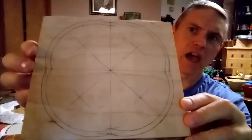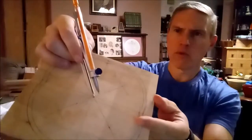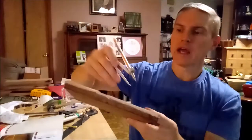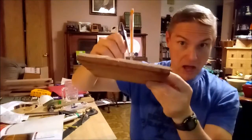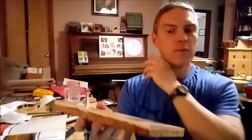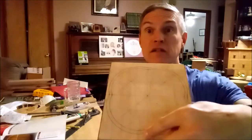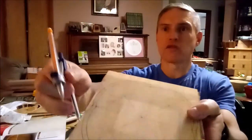This actually took some careful laying out. What I did to start the layout was find the center point on the maple board — maple is slightly smaller than the mahogany. I found the center point, marked it, and tapped it very lightly with a nail just so when I put the compass in place it would lock into place and not slide on me. From there I extended some lines at right angles to each other, out to the outside edge of the maple.